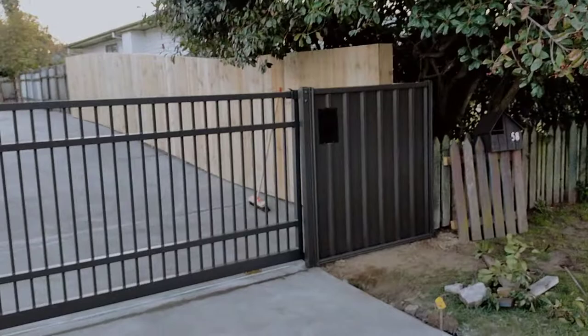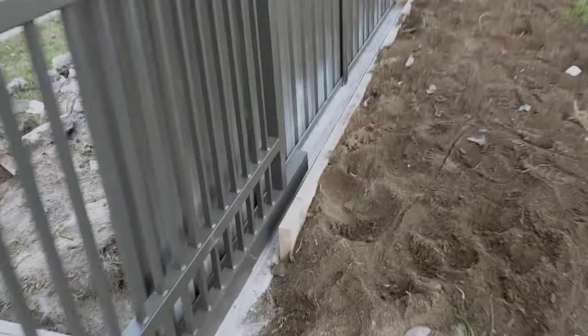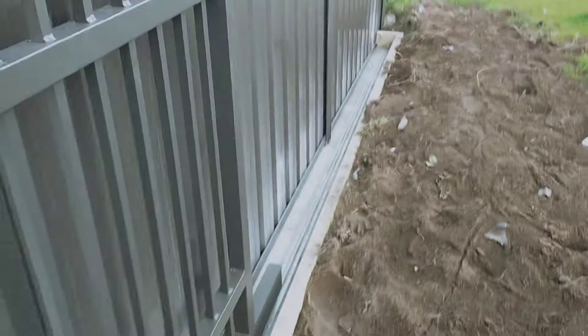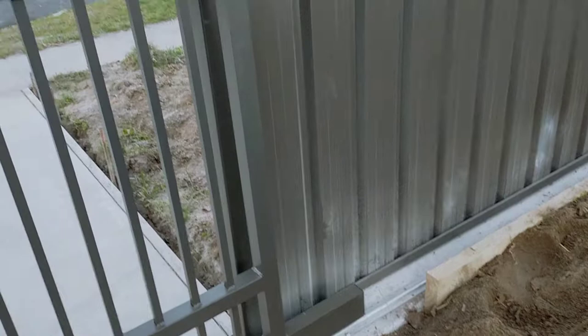Because you'd want to put a tail on the back end of the gate — it's a 300mm tail which goes along the bottom, and this is where the motor connects up to the gate. As you can see down the bottom here, this thing is called the tail. It hangs out over the end, normally about 300mm, and that gives enough clearance for the motor to be installed. You want to have the motor outside of the gate line, not on the driveway.